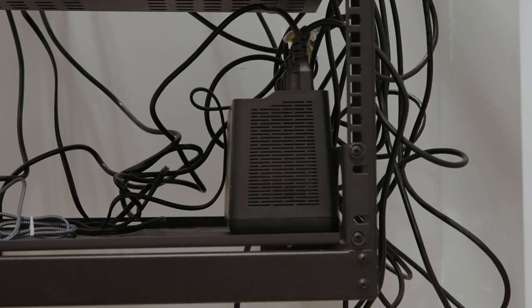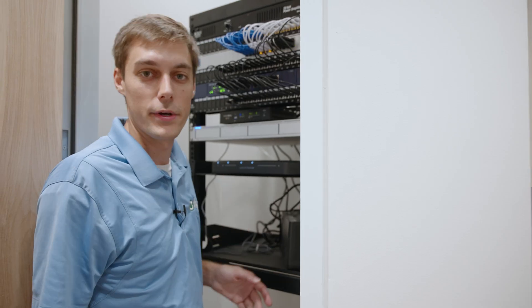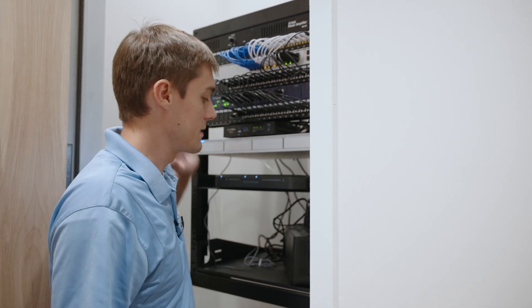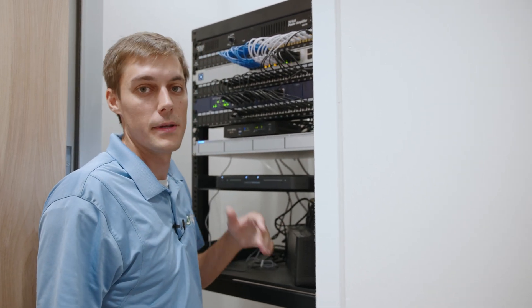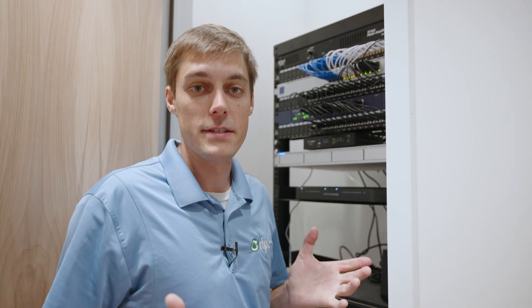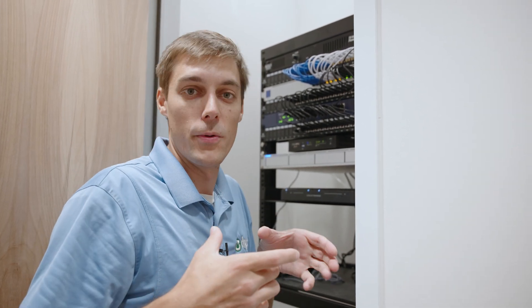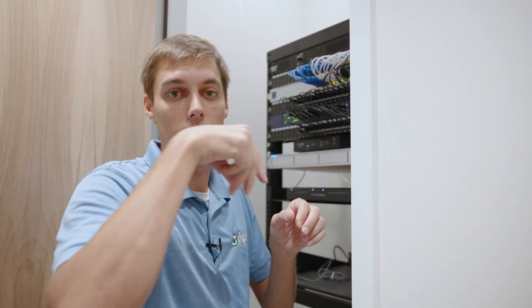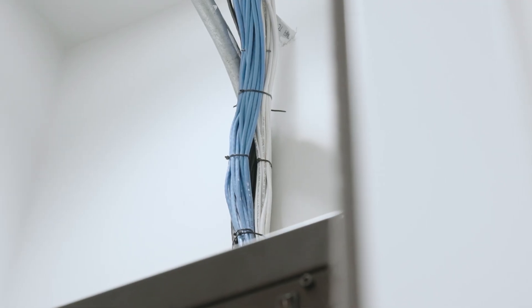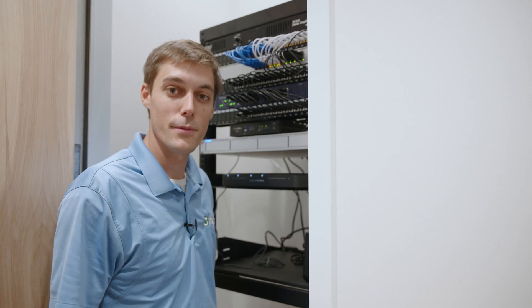To tie it all together, we have our APC for battery backup so that if you get a surge spike it doesn't take the entire network down. I have the two surge-only ports going to the NVR and the amp because we don't really need those on battery backup — it would kill the battery pretty quickly if we put everything on it. One of the other tools we like to use when terminating cables is a cable comb. It allows you to file all the cables into the comb, creates a nice organized bundle, and then as you pull the comb down you can easily zip tie right behind it.